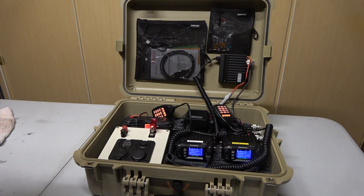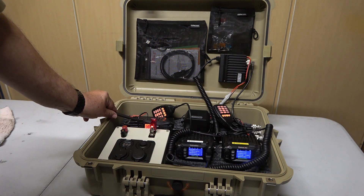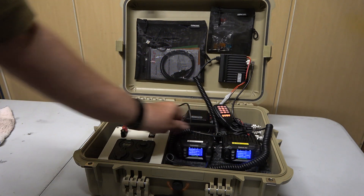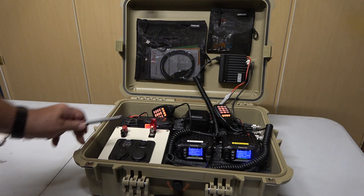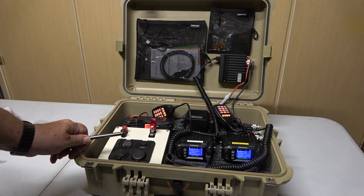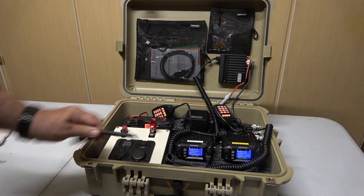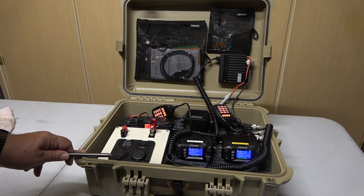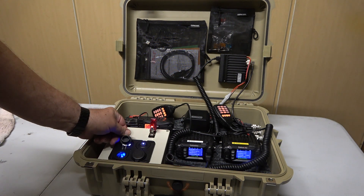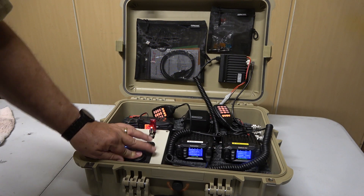Here's the primary box with all of the circuits. Here's the positive and the negative where I'm going to put my 4mm banana plugs for charging the battery, which is located right here. Here's the master switch for this box — and also the master switch for these other radios because they all connect to the distribution block. It lights up when it's on, and like many of the airplanes I flew in the Air Force, it's got a cover on it — when the cover is closed, it opens the circuit and turns everything off, so if the lid were to come down, it's not going to discharge by turning the circuit on. This little switch turns on the panel. This is the 12-volt automotive style plug, and here are a couple of USB charge ports.